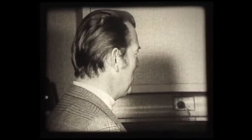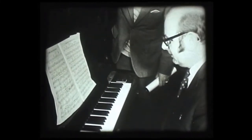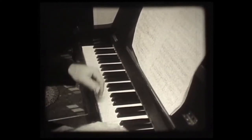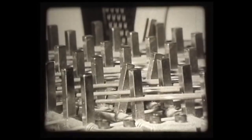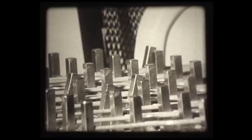Well, exactly how do you set up to make a pianola roll? Well, it all commences at the piano. We prepare an arrangement, and it's recorded on this recording piano. Would you care to play something for us now? Yes, I'll play you this version of 'It's a Sin to Tell a Lie.' As the pianist plays, the recording machine is perforating at the same time. There's one punch for each note — it's like a gigantic sewing machine. As the keys are pressed, that note cuts the hole that you saw in the roll.